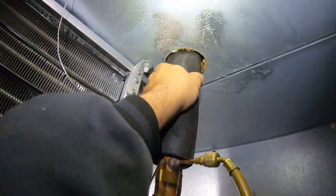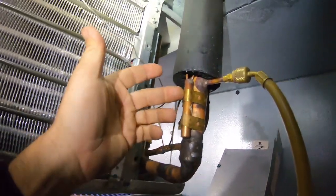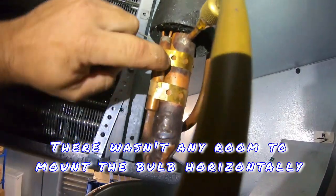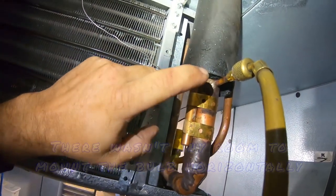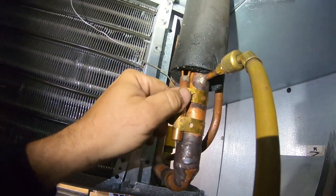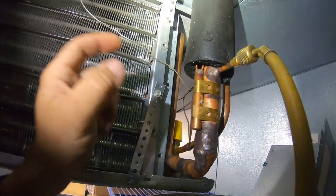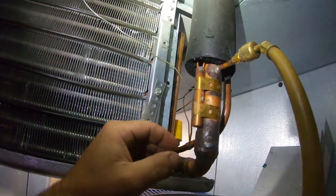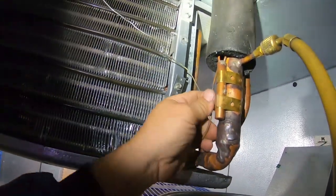I had to pull it down from below - I'll have to go back up again. Got it down to here, got my bulb attached with good connection and no gaps. You've got to use a strap - preferably copper or brass strap like they've got here. If you just tape it on, wire it on, or wire-tie it on, it does not work. I've had several problems with people doing that.